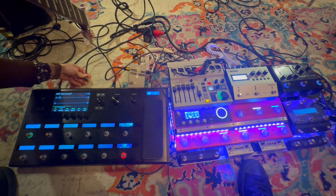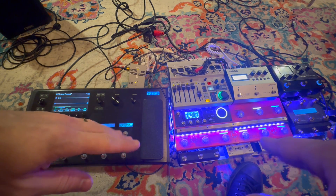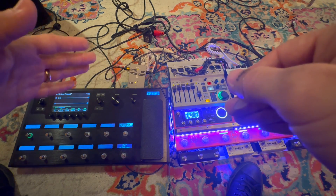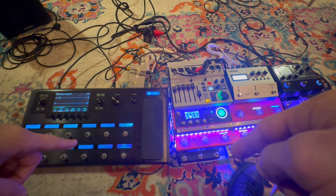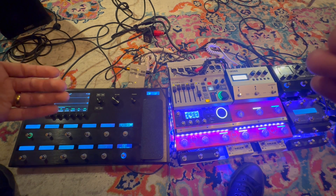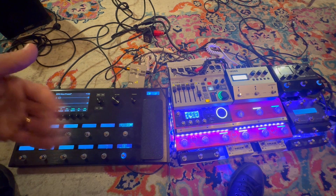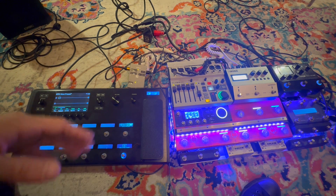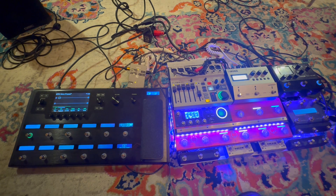This is kind of hard to explain, but when you hit start and stop and it completely stops all the loops, this unit is actually sending an all-start/all-stop message to every other unit. That is why the unit fails to continue sending the MIDI clock — because the all-start/all-stop message is embedded in the code. I don't really know why it is this way; it can be useful when you have multiple units together and you want everything to stop together, but for time-based effects it does not seem useful.